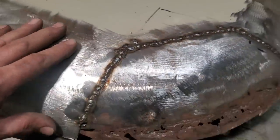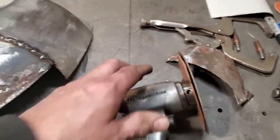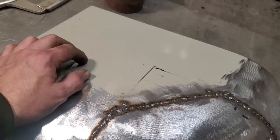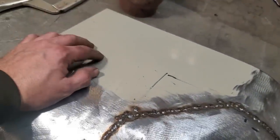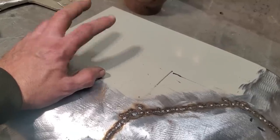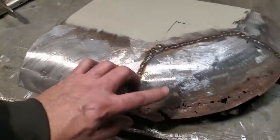It's a little bit warm from the last pass. I'm going to go ahead now and take the 24 grit grinding disc and grind all this down, okay? Never mentioned it yet, this is 18 gauge metal. It's a different color than the white stuff that I use. It's the same stuff though. It's stuff that I got maybe 6 years ago. All the stuff I got, I still got some left from it. So I still got stuff around, I can tell you that. And so I'm going to go ahead now, grind all this up, finish that off there before I move on to this here.